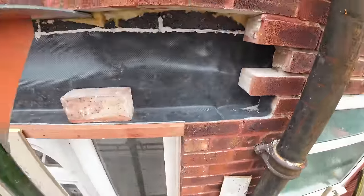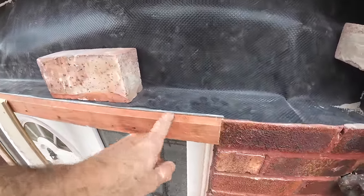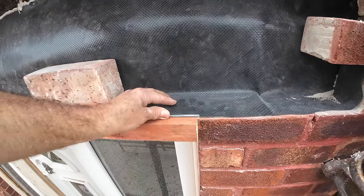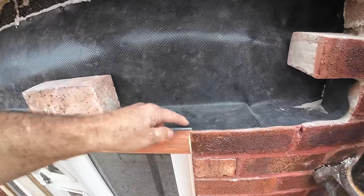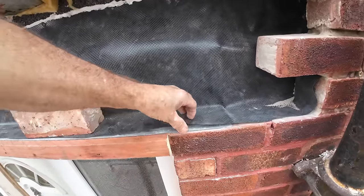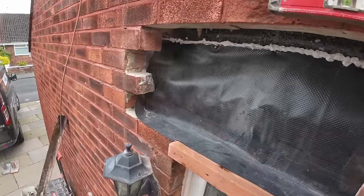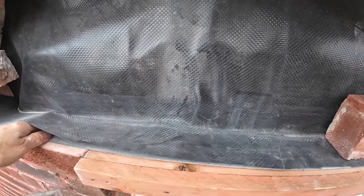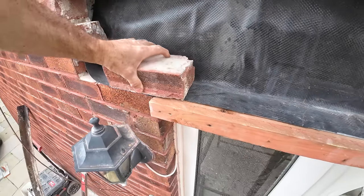It's perfect. We had this bit of old batten in the garden, so we brought that. That's been wedged into the brickwork. I've left it proud so that the soldiers have got something to sit on without falling over, so that should keep them a bit safer. This lintel just needs pushing back. I've not put a nail in to steady that yet, but yeah, this end's alright. The other end just needs pushing back. You always check by doing that.